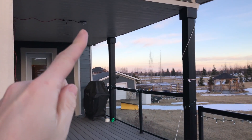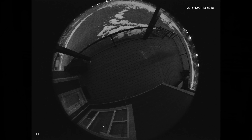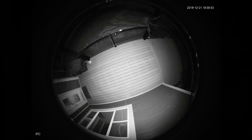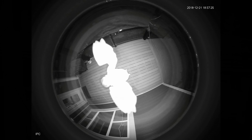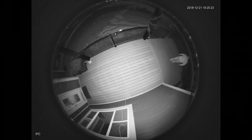For our first temporary location, let's start under the awning of my back deck. I can see everything from here — anyone exiting or entering my house, walking up the stairs, and even my back fence at 300 feet away. Walking from the fence to the door, there's not a lot of detail until I reach the 25 foot mark, and the daytime picture quality is perfect. In nighttime mode with IR lights deactivated I see nothing but a blur. With the IR lights on the image isn't very bright except for the nearby floor deck. When I step in front of the camera the IR lights blow out the image, but if I turn on BLC backlit mode the image is much brighter and the image when I walk by is adjusted and not blown out.